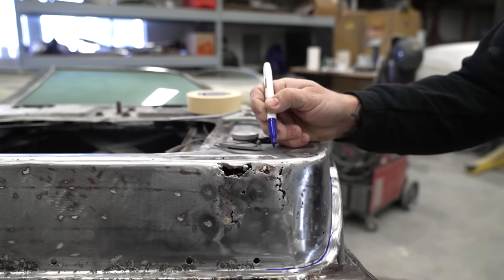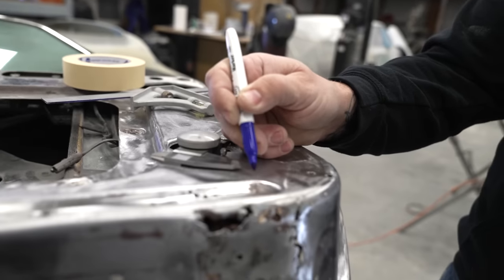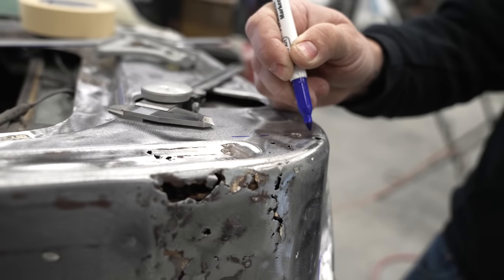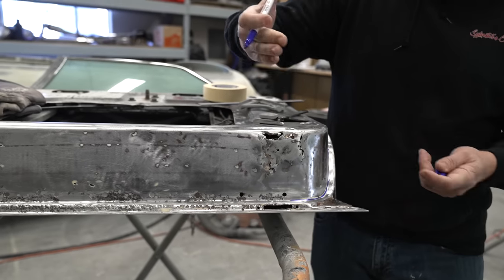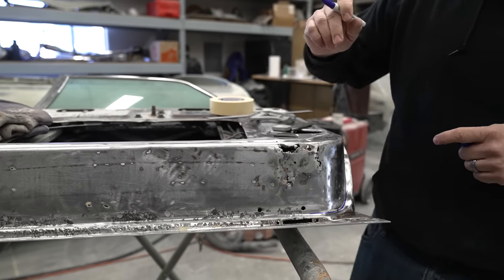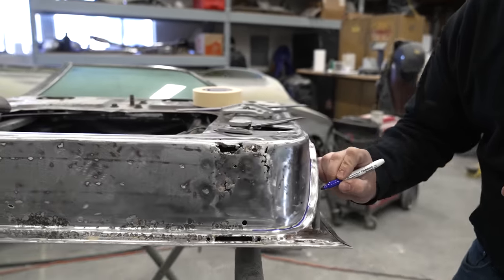And we're locating where our cancer is. So our cancer is in these areas, and because there's a brace on the inside, we're going to break it down into how we want to attack it. Well, if we have this curve, we can bend this sheet metal over our knee, over the stand, pole, whatever works. And then we need to dissect some of these other shapes.